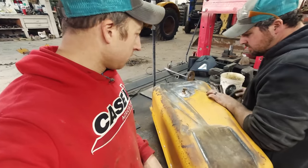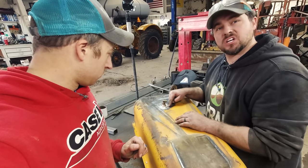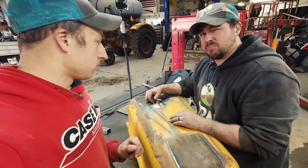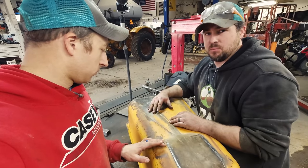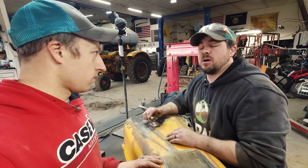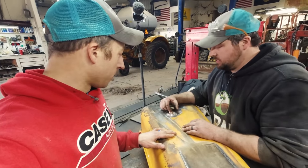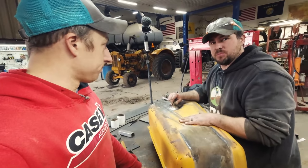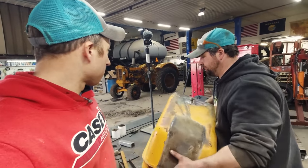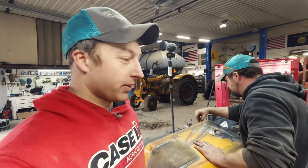Leg Arms has been working on this thing. Back in the day they used to use lead for body work and other things. This tank has got a lead bead around it to hold the fuel spout on - it might look cracked but we're not sure. The way to find out is pressurize the tank with a little bit of air and then take soapy water and check all the seams. If you have to weld on it, you've got fumes to deal with. This has been dry for a while, so we'll pressurize it slightly, take soapy water, and check everything. Tractors were very simple back then - literally a two-minute job to get the tank off.